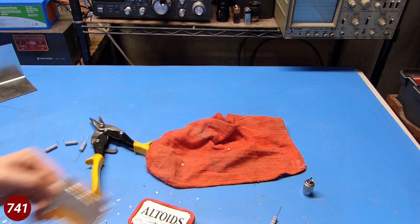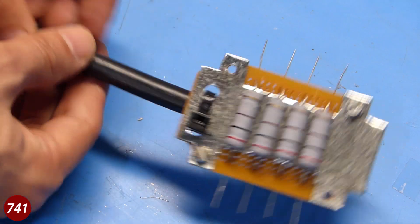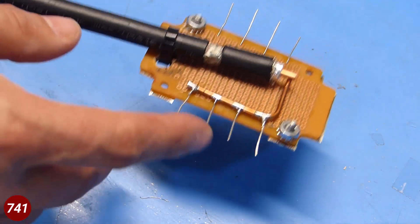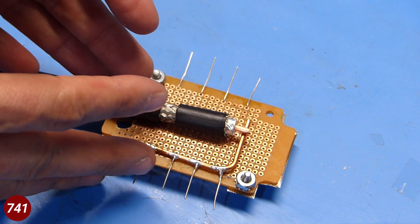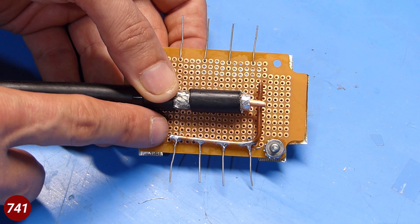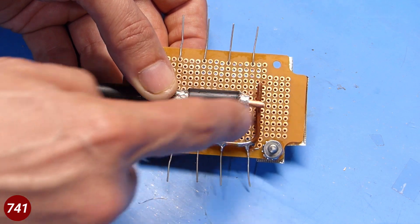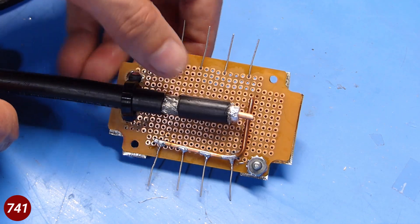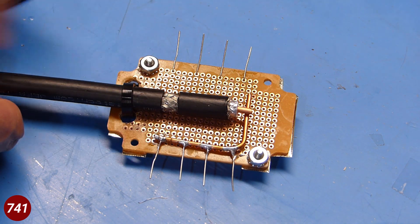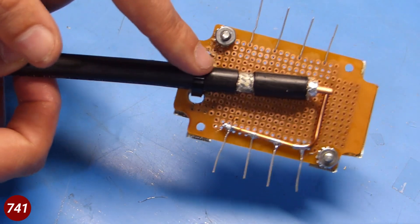I'm going to get the resistors mounted in the board and ready to solder. Here's a progress update on the build — you can see I've got all the resistors mounted in and a coax pigtail on here. This happens to be some LMR-400 clone I had laying around; I really wanted RG-8X but couldn't find it. I've got a solid copper wire soldered to all the resistor legs on one side, bent around, and I'm about to solder it to the center conductor of the coax. I've also drilled a couple of holes and put a zip tie for strain relief on the coax.